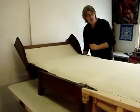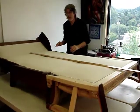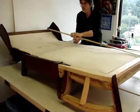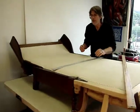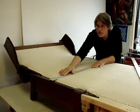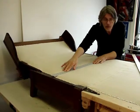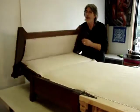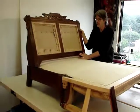The crown is also nominal. I'll put a straight edge over the top — you can see that it's landing just proud of the frame surface. When we put the final cover on, there'll be a minimal amount of cotton batting put underneath, and the cloth will be stretched tight. So our final surface will stand about three-eighths of an inch proud of the frame proper, which will allow the piece to fold over and the stuffings tuck up into the frame.